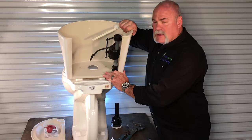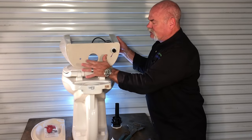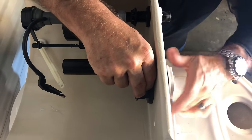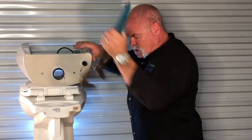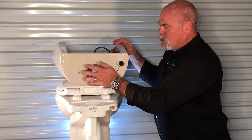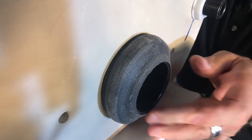As you can see now, the inside of the tank — all we have is this hole here. You want to make sure that this surface is clean, and also the surface on the bottom, so we don't have any leaks. You've got a rubber seal around here; I just like to make sure it's nice and clean. Stick it in, line it up the way that you want it. When I do this, I like to get it about hand tight and then turn it just about a quarter of a turn. And I grabbed my big channel locks for this. You can over-tighten these and crack the flush valve — I have seen people crack the bowl, normally by over-tightening the tank-to-bowl bolts. Once you get that put together, put your gasket on and push it up. You want to make sure that it goes up all the way around to the bottom of the tank and seals off around the threads real good.